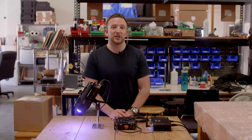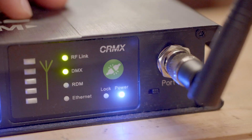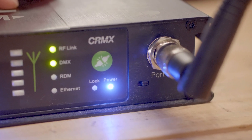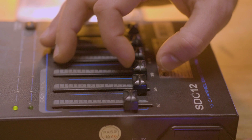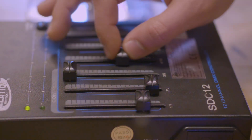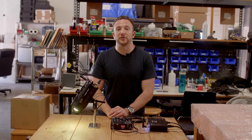You're going to want to link with the base station. Any wireless DMX transmitter is going to have a linking button — find it on whichever transmitter you're using and that will allow you to link the light. Once that transmitter has indicated that the light is linked, you'll be able to use your board without having it plugged into the light itself. As you can see, I'm now able to adjust the settings on the light without our DMX board plugged in. You should have up to about a hundred foot range very easily with CRMX, often much farther.